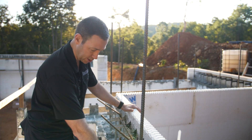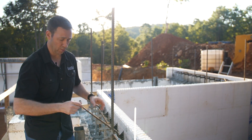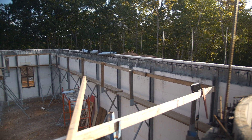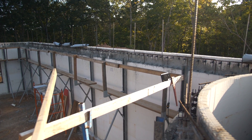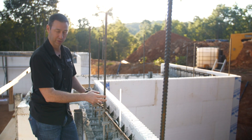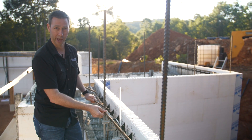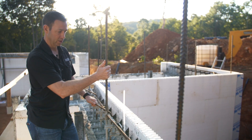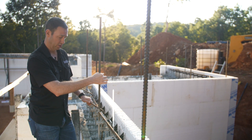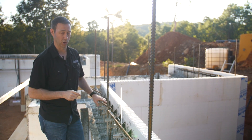You've got concrete filling this cell — approximately a 6-inch continuous concrete wall, with no breaks. There's a series of rebar laid in, and you can see there are cages in there with a horizontal and vertical grid. He's got a mix of number 4 and number 5 bar. A number 4 bar is 4/8ths — basically a half-inch bar — and the thicker verticals are number 5, or 5/8ths of an inch. This is a grid network, so when the concrete is poured, it's a super strong wall.